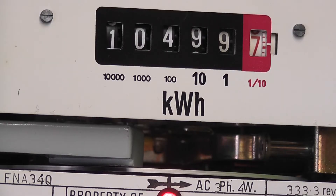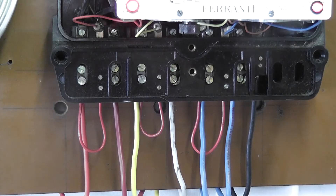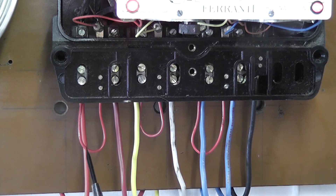I've increased the load so I get about a 30 amp load on the meter. We are just going to reveal the click-over between the higher digits. To make the CT meter work I had to put jumpers in between the current wires and the potential wires.